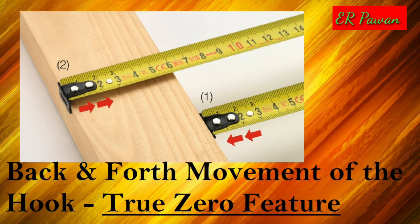Feature 6: Mark your measurements with a V. When you make a measurement and mark it, make sure the side of the tape is flat against the surface. The tape is naturally cupped out from the surface, so give it a twist to get one edge flat. Mark your measurement on a board with a V-point, so you can be sure the point is correct. Without the second line and the point, someone could use the wrong end of your mark and cut the wrong length.